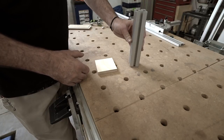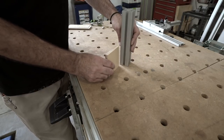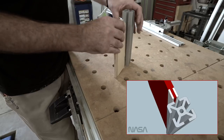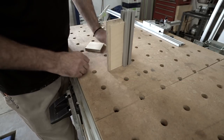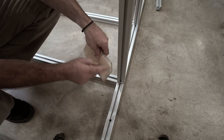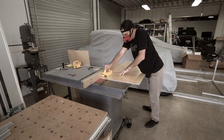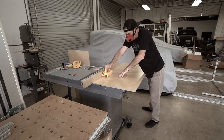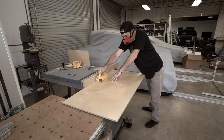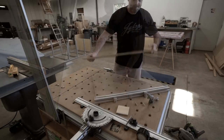The dividers in the workbench are made up of 8020 uprights with half-inch plywood walls. The problem is this extrusion doesn't support half-inch thickness for the walls, so what I've had to do is dado each side of the wall so that it slips into the extrusion. Also, because we are using internal fasteners, our sidewalls won't be able to fit all the way down because they hit the fastener, so we're having to notch every corner so it slides right into place. To machine all of these dados, I set up my dado set with a scrap piece of ply — the idea is to get the inserts to a final thickness that just barely allows you to insert the panels into the 8020 by hand, with no play or rattle. Afterwards I set up a little makeshift jig with 8020 to cut all the corners, and before long I was able to start mocking it all up.